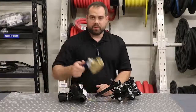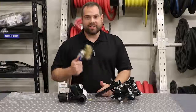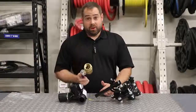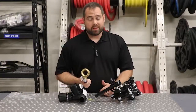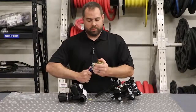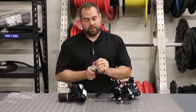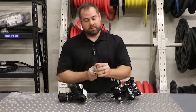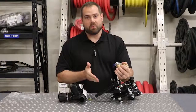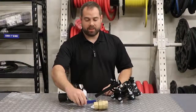The third type is called a ball valve. I'm sure we're all familiar with this — it's your bare bones, basic, economical way to do things. It's pro: it's only a couple bucks. It's con: everything else. You can close off your media flow, turn on your media flow, but it's not precise. It's quick, but you can't really tell where you're at if you ever have to go back to that position. But in a pinch, it'll get you done.